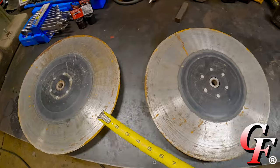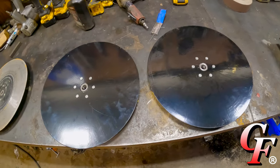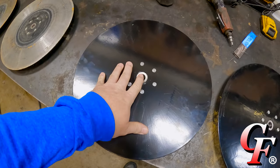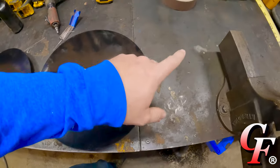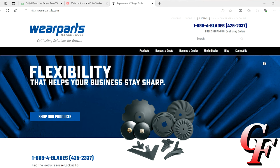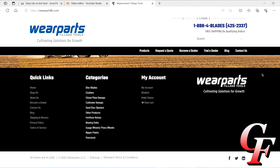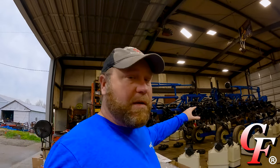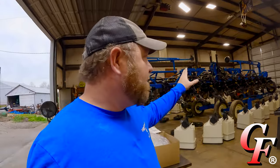For the rear we've got two different options here. We're supposed to have a third one but it hasn't showed up yet. We've got another factory Kinze disc opener, a WearParts LLC Selsen disc opener, and we're going to have a WearParts LLC Forged New disc opener. Late last summer Eric of WearParts stopped by our shop showing us their products and wanted us to do a trial with our planter. All the back rows we're replacing — we're going to do six rows with Selsen disc openers, one row with factory Kinze, and five rows with the Forged New disc openers. These are supposed to be better than factory OEM.